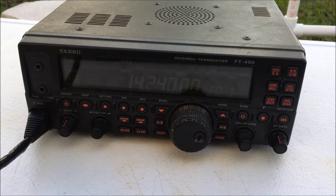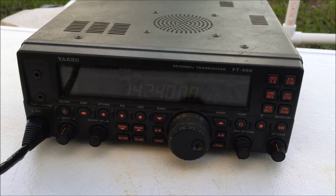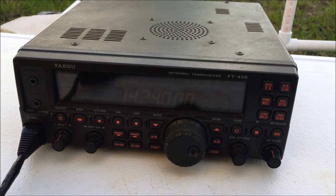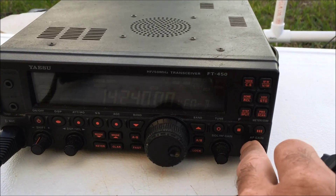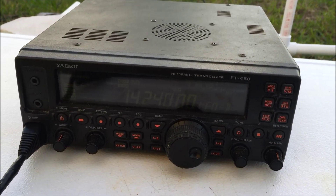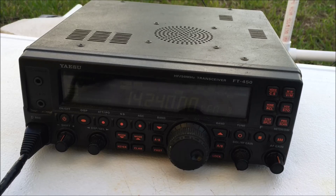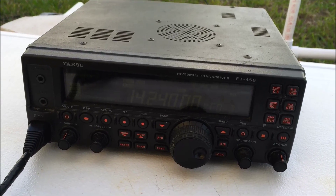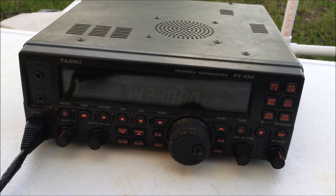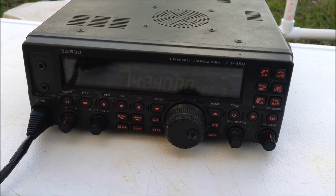You have really good audio. I'm running 8 watts right now in the driveway with a MFJ QRP pocket loop tuner, with a homemade loop in the form of a 3.5-foot-wide diamond. The other station replies: fine on the loop, sitting in the driveway, 8 watts — no problem. He's running about 1,400 watts to a 3-element Yagi at about 55 feet. But we are 100% copyable — it's working.